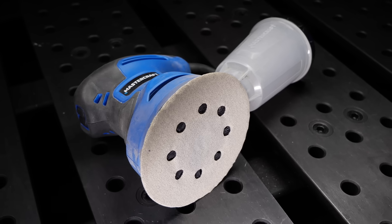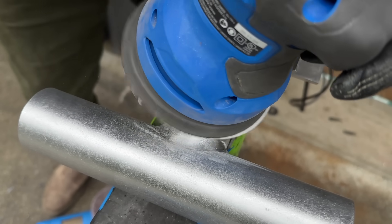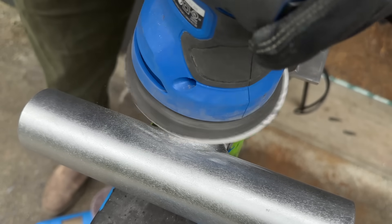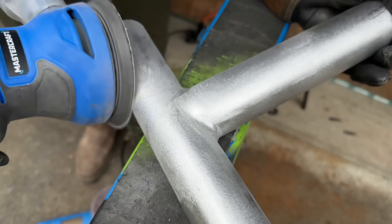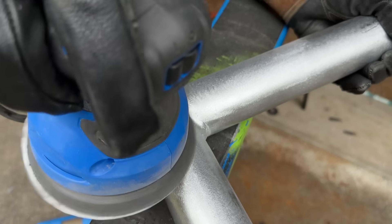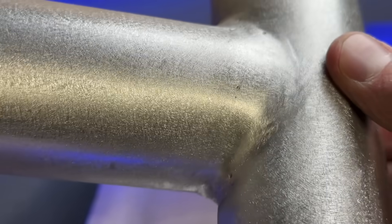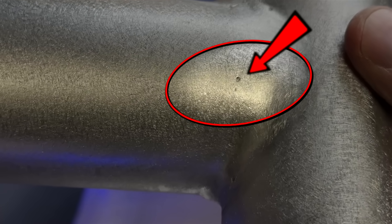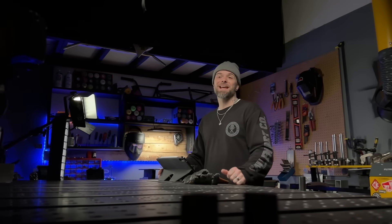I'm going to grab an orbital sander — 80 grit — and this is where I'm really going to work some magic to blend everything together. I'm working with the flat spot on the pad and rolling over the profile of the pipe, not holding the disc up on its edge, just continuing the shape over areas I've focused on with the grinder. You may start to notice little bits of porosity here and there — super annoying. This can happen when little bits haven't been properly fused together, or the arc and gas can go ways they aren't normally meant to, causing gas inclusion or porosity in your welding.